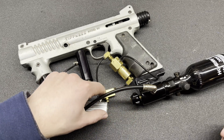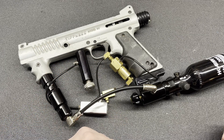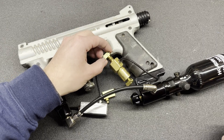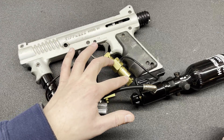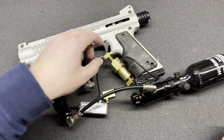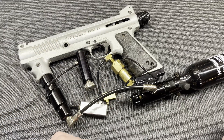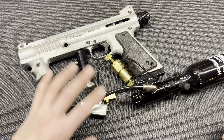By adjusting this flow control I'll be able to affect the dwell of this mechanism, and I'm hoping the exhaust valves will also reduce the time it takes the system to reset. There are no springs inside, so essentially after it cycles you have a pressurized unit that needs to bleed off before it can cycle again. In stock form that doesn't take long, but when it comes to cycling a paintball marker it's too long.